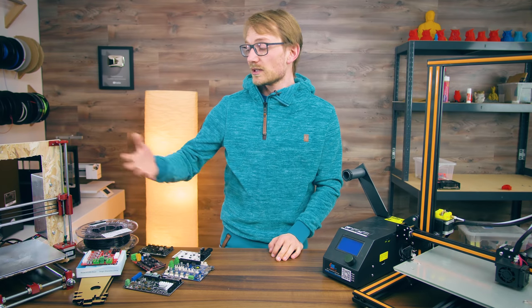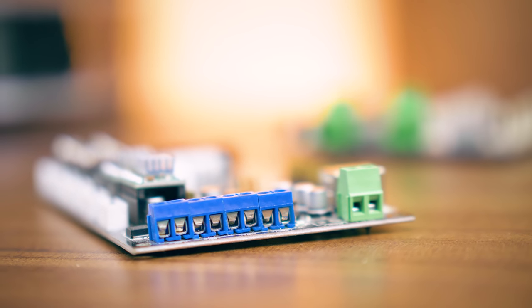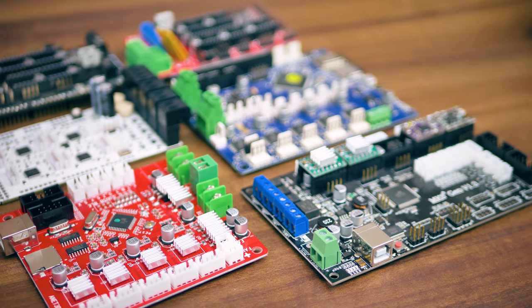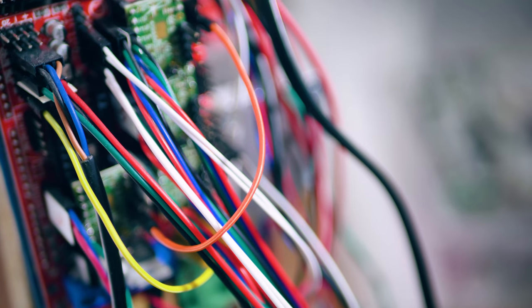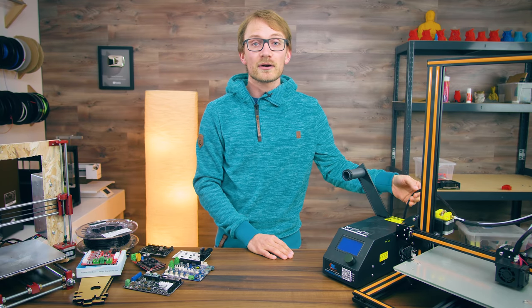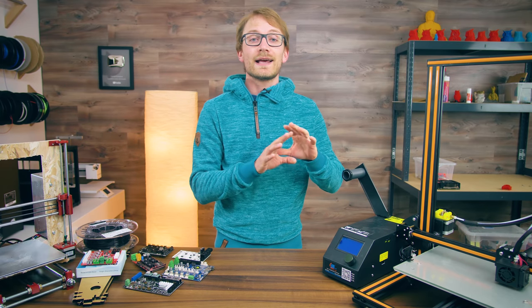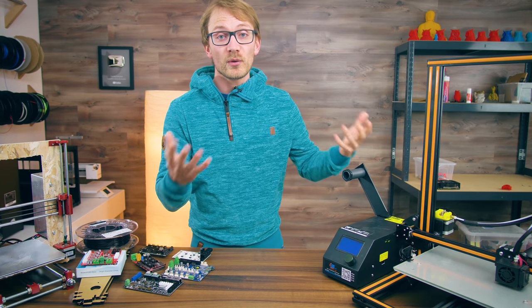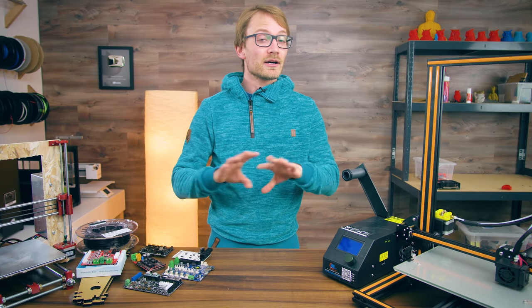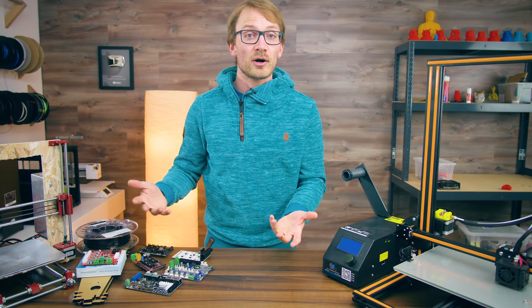Pretty much all the ways a 3D printer could fail are electrical fires, which means wires, connectors, or individual components getting so hot that either some of the plastic insulation starts burning or it ignites something else that the wire is touching. A few versions of wire insulation and connectors are actually flame retardant, meaning that should something overheat, the plastic will melt, but even with an open flame touching it, there's an added chemical that will keep it from actively burning. However, most other parts on a 3D printer are typically not flame retardant, and obviously the frame is the biggest flammable part, if it is flammable.